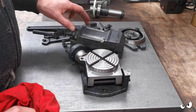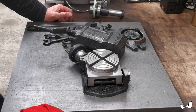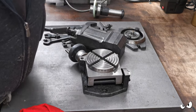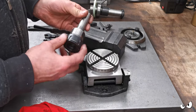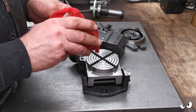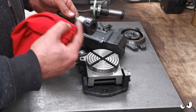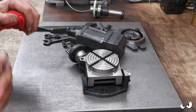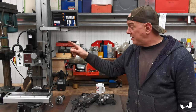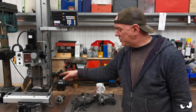So if someone's looking to learn all this stuff, this is basically the basics. You are going to need to get a collet chuck — I'm keeping mine — something like that, and a set of collets. That's just the MT3 ER32. If you are going to actually be using milling bits, you need one of these and not just the Jacobs chuck. So essentially it's the mill as it stands with the chuck, and it's also going to have the scales on it for X, Y and Z axis.